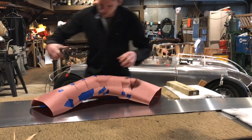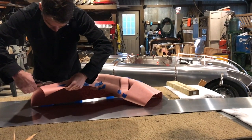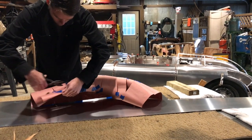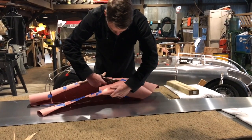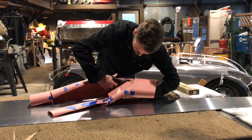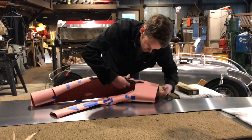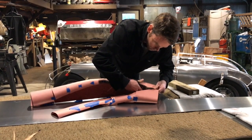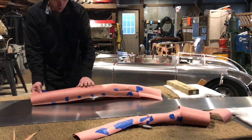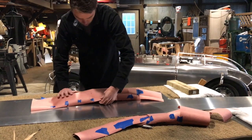So by cutting that, it's gonna get rid of this extra spring, which is a similar behavior that would take place with metal. It's gonna wanna be sprung like that. Now, my metal is going to overlap from piece to piece, so you've got a little bit of forgiveness and wiggle room, I guess, to work under with your overlap. I'm gonna envision this edge as the flat edge that we started with over there, and all of this, the material out here, to be shrunk.